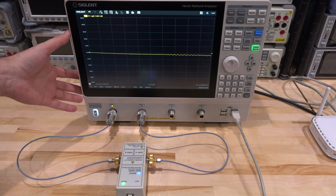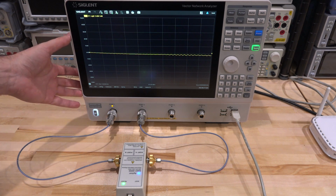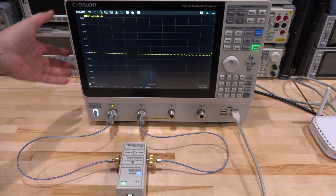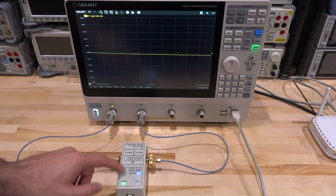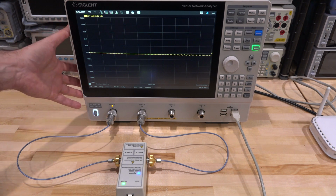The very first thing to do to get a network analysis is to do a calibration. Now the instrument supports a variety of passive as well as electronic calibration units, and once you connect this to the USB, it automatically detects it, and it has a list of supported ones that of course you can work with. So first thing first, let's go ahead and calibrate channel 1 and channel 2 using this ecal, and then I have something to measure to push the dynamic range of the instrument